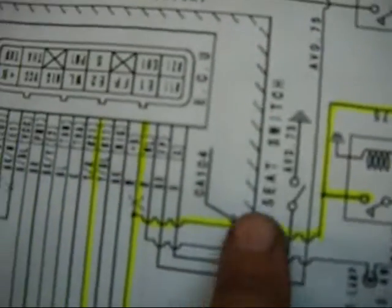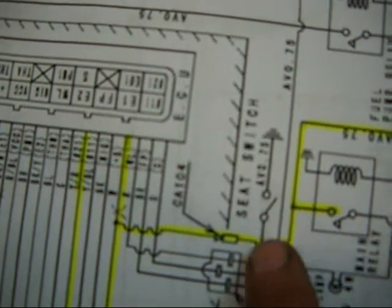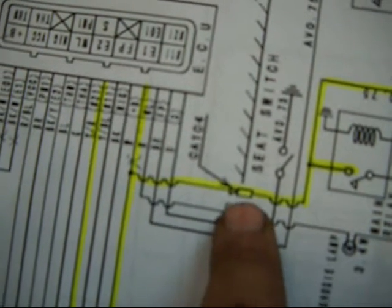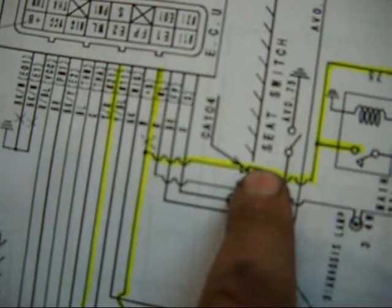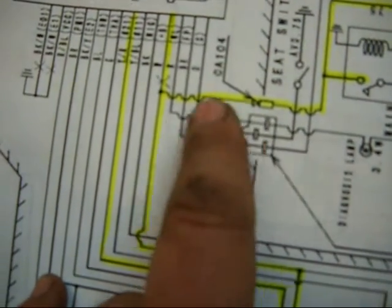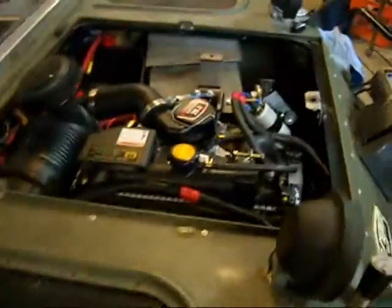Notice this little seat switch — that was a tricky one. It needed to be grounded. Some of these lawnmower equipment setups have a seat switch, so that had to actually be grounded. And then this little connector right next to the pigtail had to be key-on power, which the diagram calls AV075 power, which is on the key system — right off the ignition switch. So there it is, it's running.